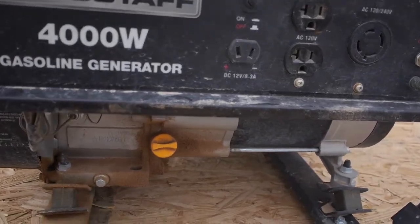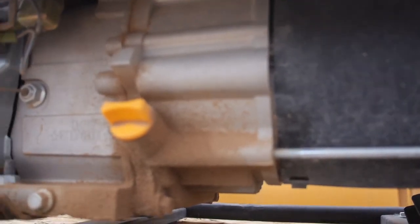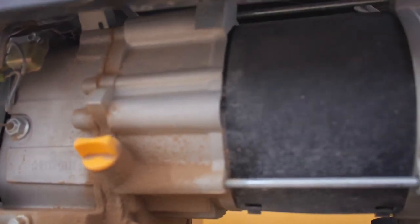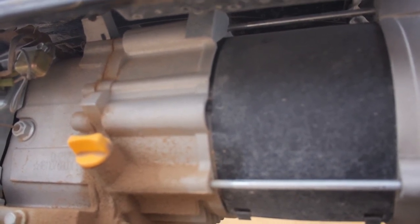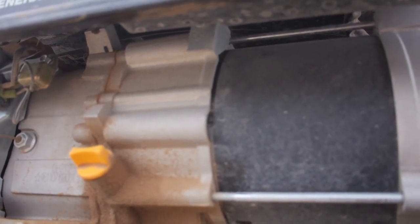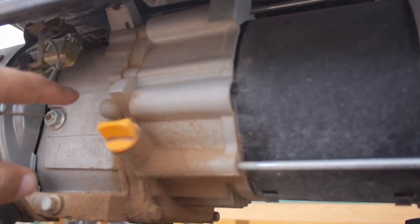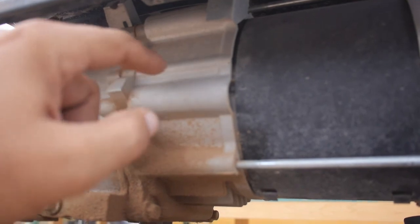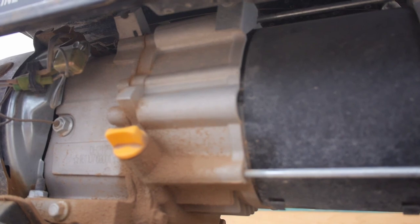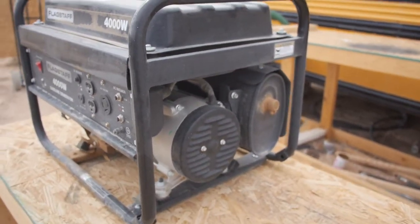The casting is very similar, with the exception of the rear half of the motor case, which is not the same — because they had to make it so the generator can connect to it. Think of it like the bell housing on your car's transmission. That piece is removable from the motor, so my plan is to completely disassemble this, take that piece off the new motor, switch it with the old one, then reassemble everything with the new motor.